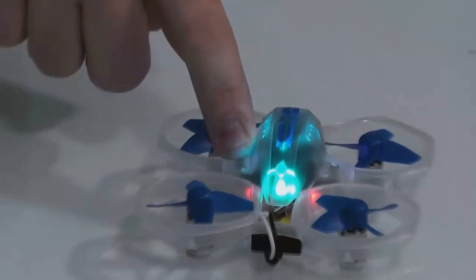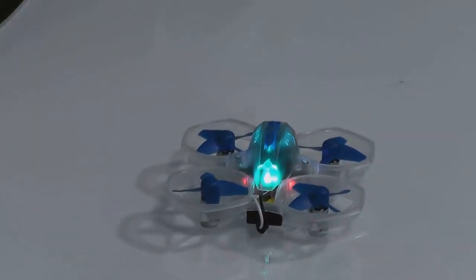A couple of other really cool features we've integrated: there's a forward-programmable channel-changing VTX. The video transmitter can actually be programmed straight from your transmitter — just go into a Spektrum Gen 2 transmitter, select your channel, select your band, hit send, and it'll change the channel. It's also got a color-changing LED on the back — I chose a little baby blue for the video. And it has meow mode, which is a big thing.